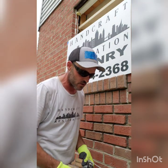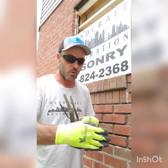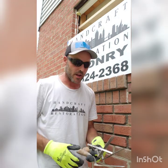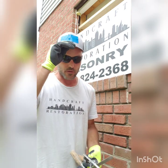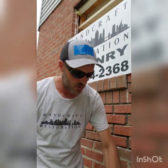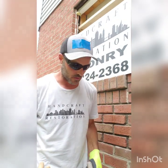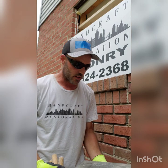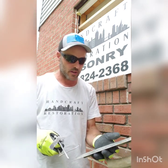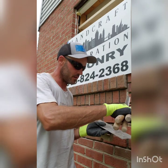A lot of people use something called a hawk board — it's just a big square board with a handle on the bottom. I hate those things. They hurt my wrist, make my hands cramp up. Plus it holds a lot of mud, which is good when you're doing a lot of production, but for something small and tedious like this we don't need that. I'll use something as small as a duckbill trowel for really small tuck pointing jobs, but what I really like to use is a concrete finishing trowel — it's easy to hold, I can just put my hand under there, put a little bit of mortar on the board, and start tuck pointing.